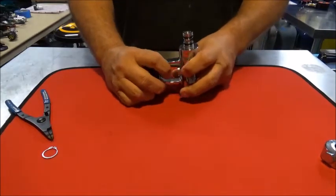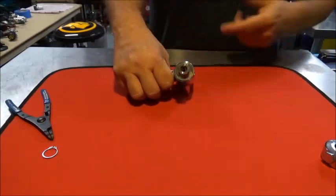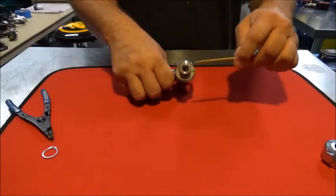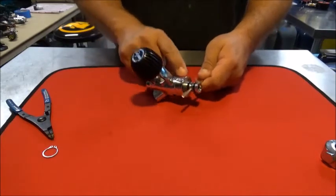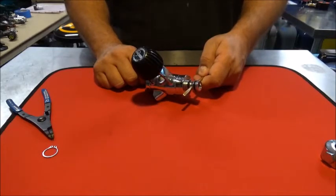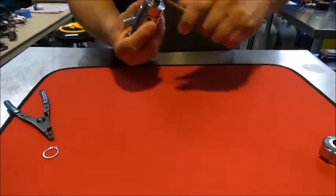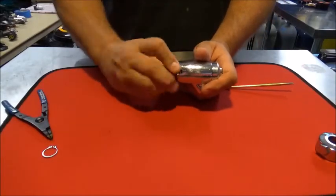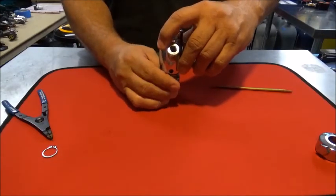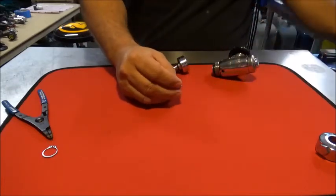Here's something interesting. We need to remove this section, and you can see the holes in it. Part of the manual says put a screwdriver or something suitable in the holes and give it a turn, which is a little bit unusual, but we'll go ahead and give it a shot. I use a brass rod, but quite often the first time you take these apart, this is going to be on here solid - it could be because of corrosion, or whoever decided they needed to torque it over. As it gets close to being all the way off, you want to turn it facing up because there's two springs in the bottom of this and you don't want to lose them.